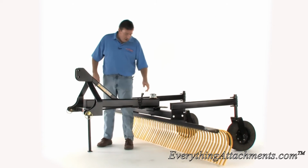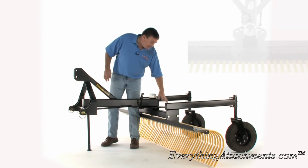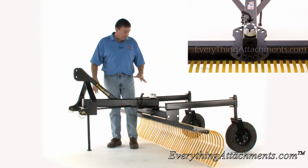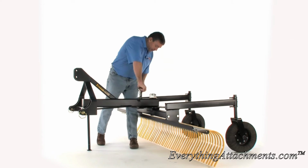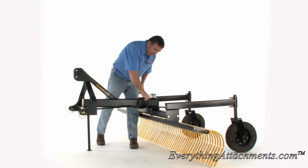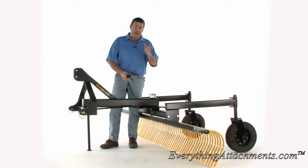All right, right there. On the pin where you do your adjustment, this has 8 different angling positions on the forwards and the reverse position. Now, I hand punch these myself, and if you'll notice, the pin fits really tight. You barely can move it to either side, but it does have some room from front to back. All right, so that keeps the play out of the back.